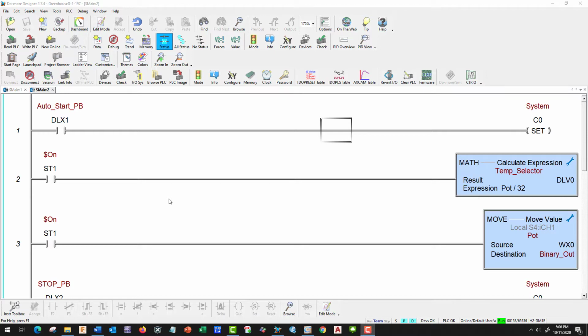We need to make sure that the devices aren't going to slam. So if you have a single temperature that turns on and off, once it starts up, it's going to shut off very quickly and slam the thing, and then kind of oscillate between the two on and off, and that's not what we want. We want to have a reasonable distance between the on and the off levels.